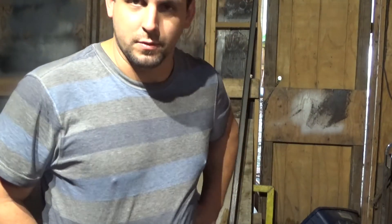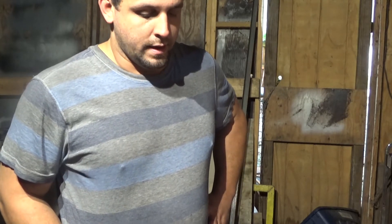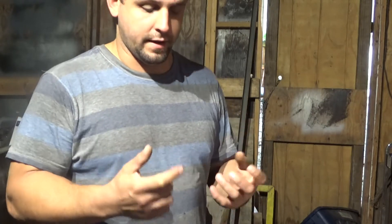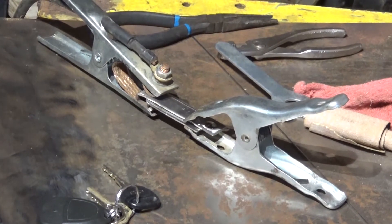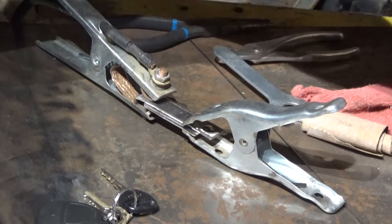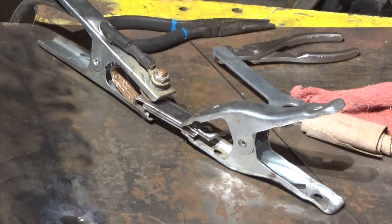When I did that weld I wasn't moving that slow, so I knew something wasn't right. I mean, I know I haven't done stainless before, but my travel speed was probably just a little bit slower than it should be because I couldn't figure out how to get it going right. The gap is a lot worse now since I had to bend those pieces apart. I ground it clean and polished it again, and I'm going to go ahead and try to tack it now and see if it does a better job with the right gas.